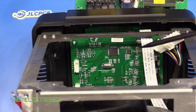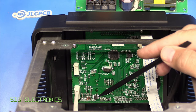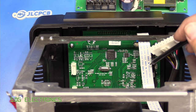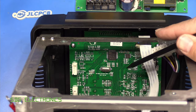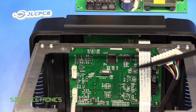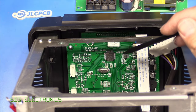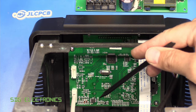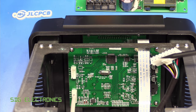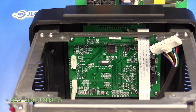At the front here we've just got the basic control PCB — there's really not a lot on here. There's a bit of analog electronics at the bottom here for the temperature sensing, and it's just got an ARM processor doing all of the processing. There's another regulator, a buzzer which might be annoying, and that's it. So really it's just taking in some inputs from the buttons at the front, driving an LCD directly, reading the analog input from the temperature sensor, and sending a digital control signal to the motor controller on the main PCB. Not doing a great deal, hence why this PCB is really quite simple.